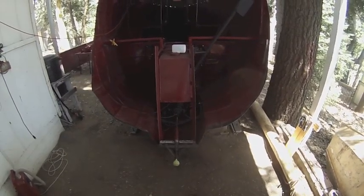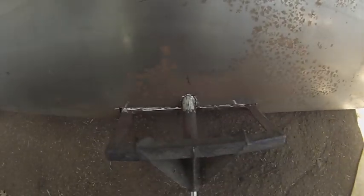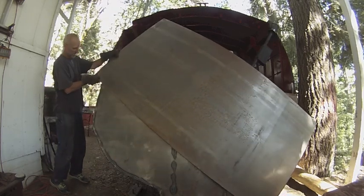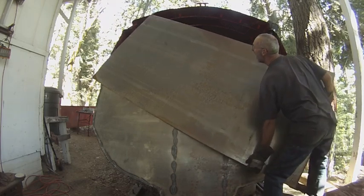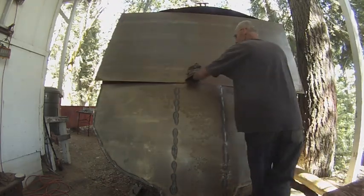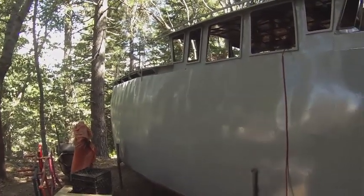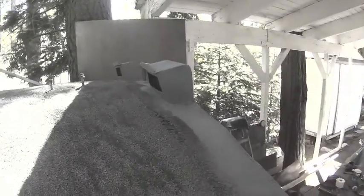It's time to seal up the stern — this was an easy piece to fit. Got the stern primered. Here I've left it raw metal because I'm going to put coal tar epoxy there. I think the water line will be about here, but I might as well make it higher to protect all the metal the best I can. The sides are already done with unit rig gray — it's just the first coat. These little boxes at the top are vents for the engine compartment. They'll have doors on them in the future.